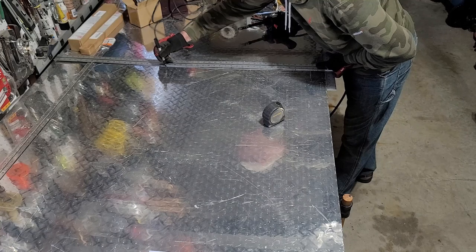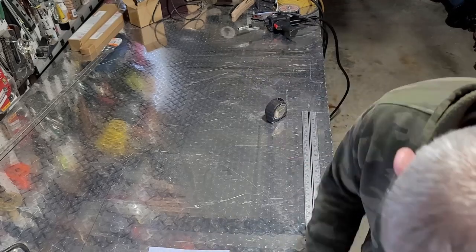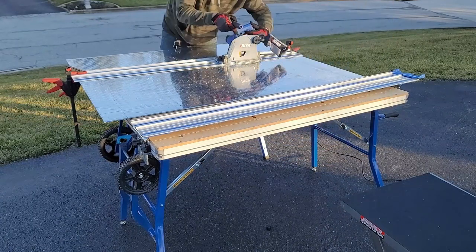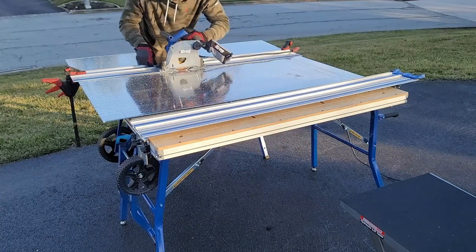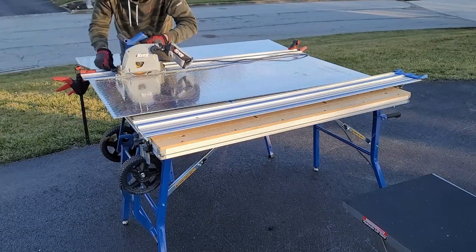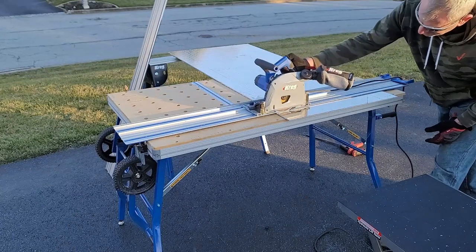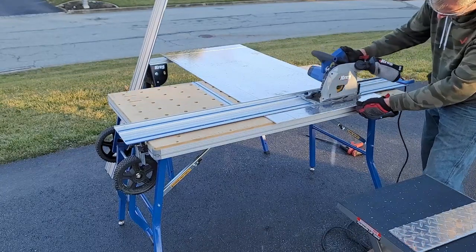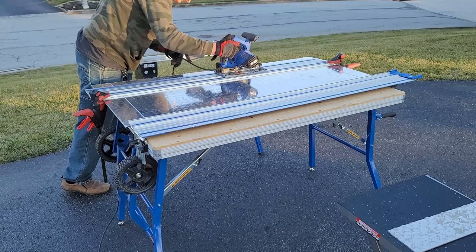With the main box welded up, I grab the second sheet of diamond plate aluminum and start marking out the lid just like I did on the main box. With the lid all marked up, I start by cutting out the outside and then I'm going to score all my bends. I have never bent aluminum past 90 degrees before, so my plan is to do almost the same as I did for the box — I'm going to score half the thickness, but this time go wider than the thickness of the material so it has room to fold in.